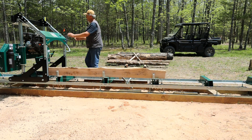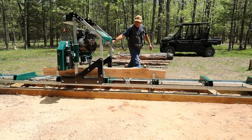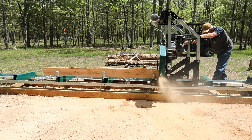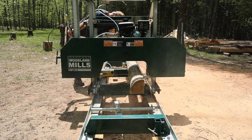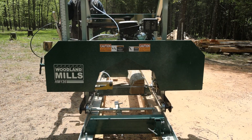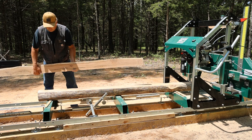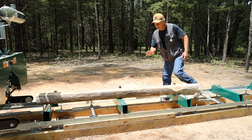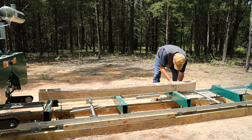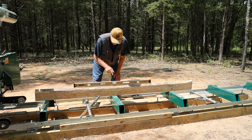Let's trim it down and see what we end up with. We definitely made a nice cut through the bark line there, and surprisingly the log is solid throughout — that is nice to see. Now before we cut our last live edge off of this, we know this line will be level, and we are dead on the numbers there. So I will say I think that will work — just being able to place a level on, get everything pinned in and ready to mill, rather than measuring each end of the log repeatedly.